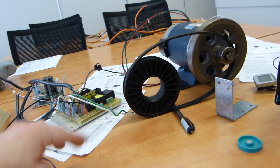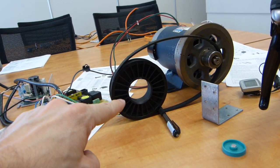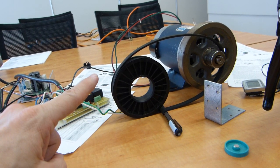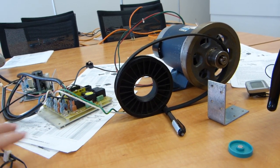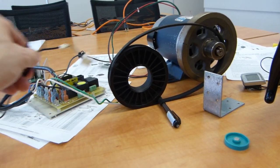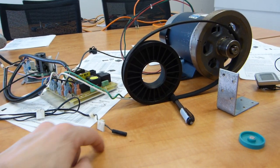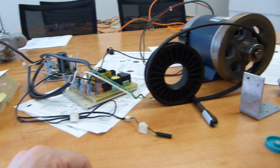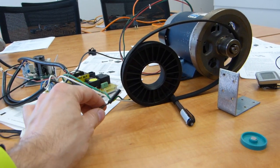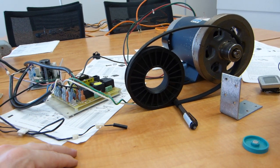So the rotating components, the track itself, the roller, the pulley, the belt, the flywheel, all of these rotate and vibrate. So however this wire is placed on the frame of the machine in the neighborhood of these components, it can get entangled, it can get torn, this sensor can be shredded. It's not really possible to place it any other place. It has to be kind of underneath the machine.